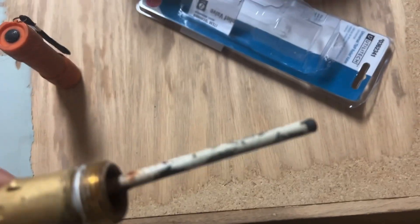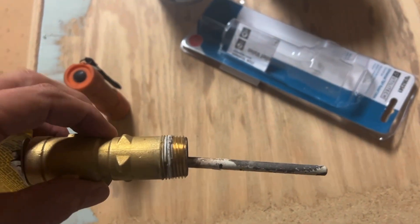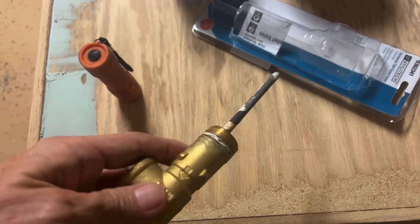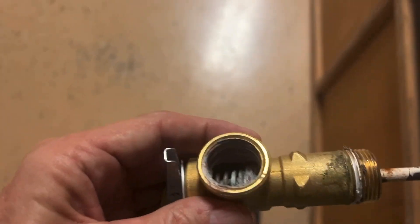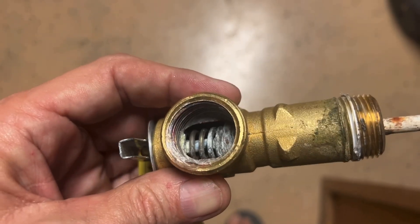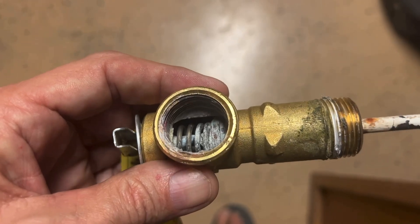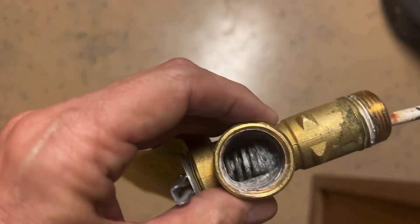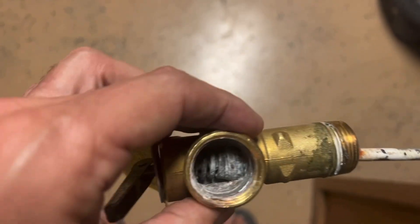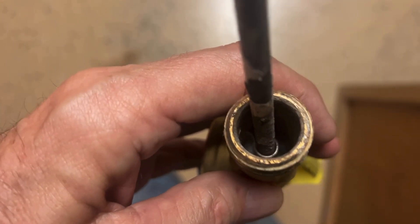This is the old pressure valve. Do you see where the white has come off on here? That's supposed to be solid white. Look right in here — this has been cleaned. I had this in acetone for about four hours, submerged. Then I got a screwdriver and broke off all the deposits, the mineral deposits that are in the water. Otherwise, this spring was stuck together, and inside too there was a lot of buildup down in there.